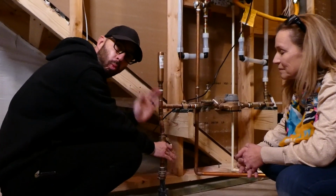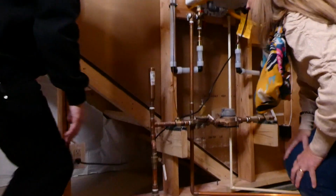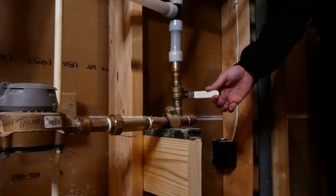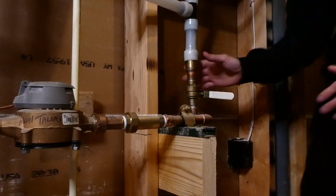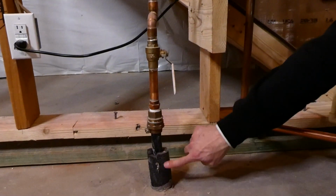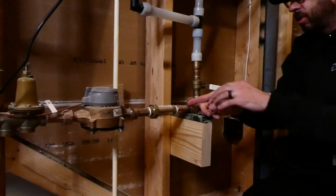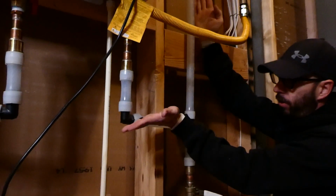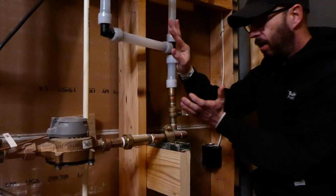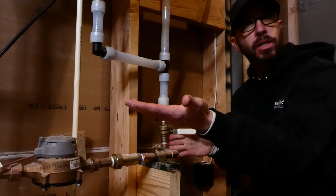There is usually at least one lever before your water meter. There's usually a lever after as well, which would be right here. So with either one of these, I just killed the water to the home. Let's look at the entire path of water flow. It's going to start here, flow up, then travel through the meter, and now it's going to feed the home and the yard. So either of these levers, anywhere before it feeds the house, will kill the water to the home. You can throw it here, you could throw it there. Either one will do just fine.